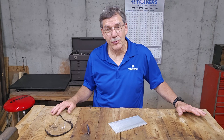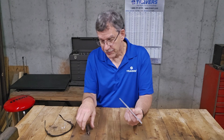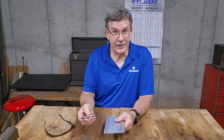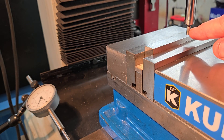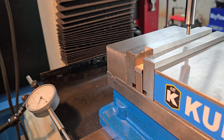Hi, I'm Kurt and I'm with Traverse Tool Company. Have you ever needed to machine something in a workpiece and needed to get it an exact distance from an edge? To do that and get it exact, you need an edge finder. If you're not familiar with how to use an edge finder, this video is for you — and you're going to be surprised at how easy it is. I'm going to use an edge finder with a 200 thousandths diameter tip. Let's get it going and I'll show you how they work.